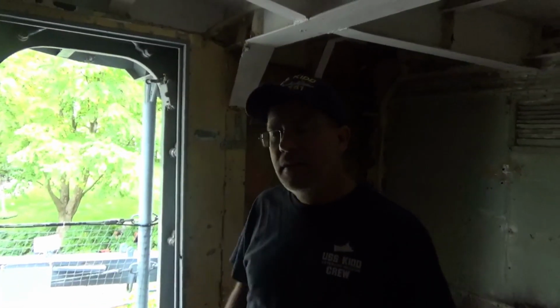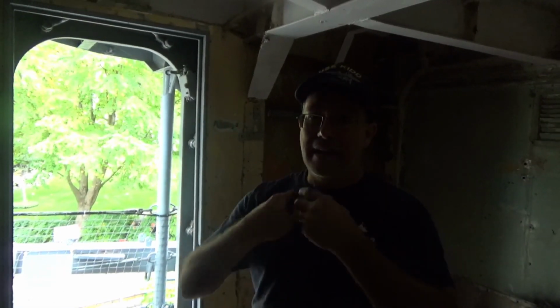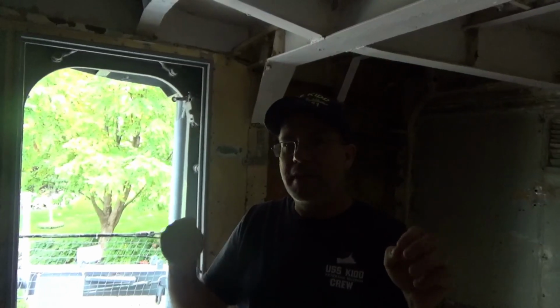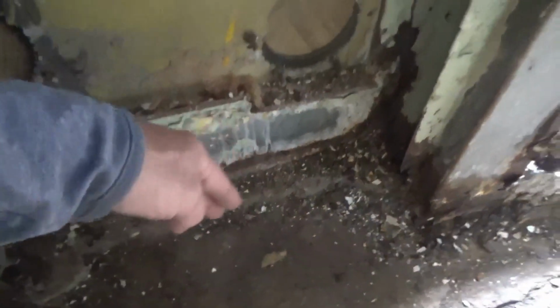so that tile would fit down perfectly flat. And as we all know, concrete, cement, that chemical reaction that takes place when you mix it all together, it never stops, even after it gets hard. Its entire lifespan, it's exuding moisture a little bit at a time. And when you put it against steel, that concrete on the bottom is still exuding that moisture. The moisture has no place to go, and it eats away the metal. So we had on Kidd eaten through the bulkhead to the exterior. Like you're eating through here, right? And then downward.